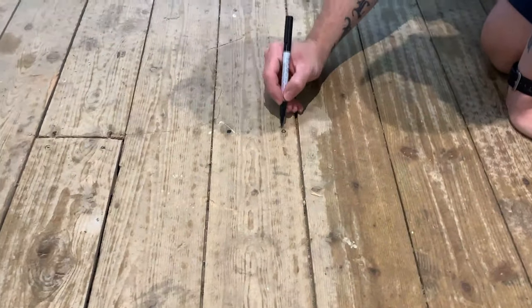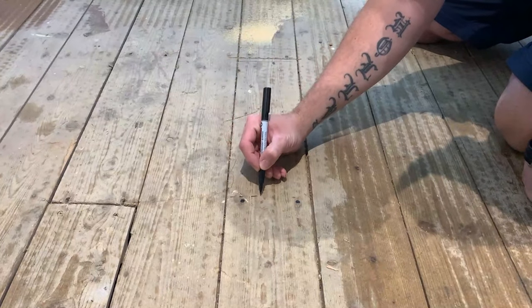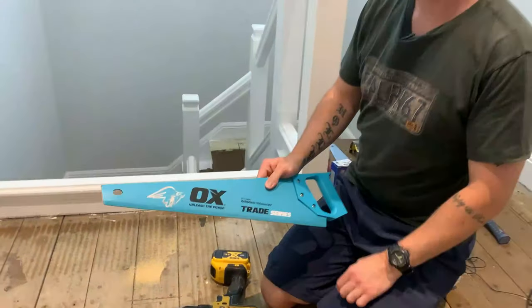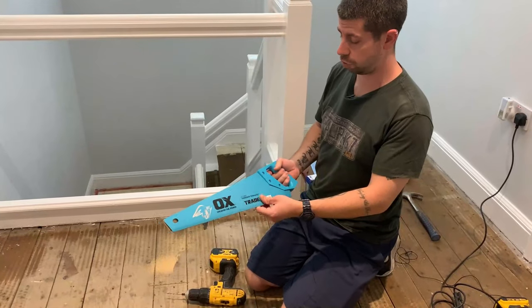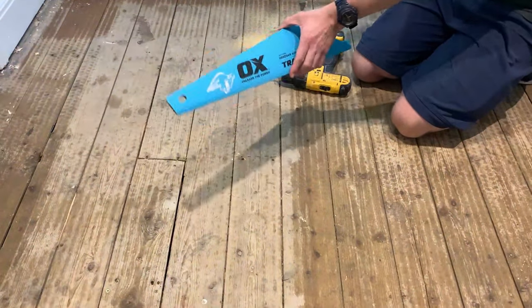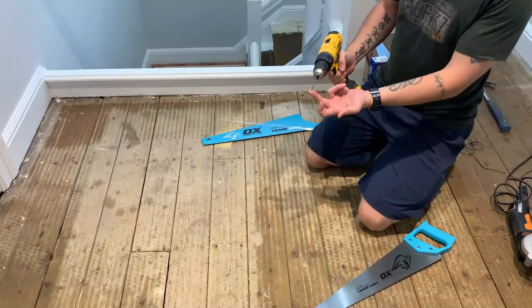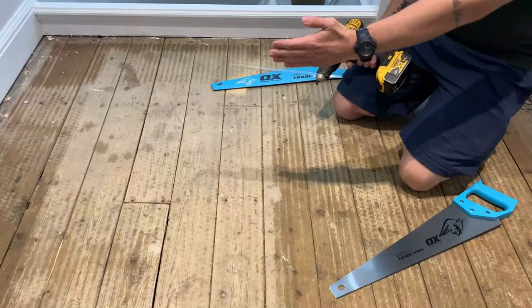That's where the nails are. I want to take this piece out so I'm going to come this side of the nails. I'm going to be using this saw for the first time — it was supplied by Ox Tools. I've heard great things about them but never actually used them; they sent me a few tools to try out. If I tried to cut through that with a panel saw it'd be quite difficult to get a start, so if you haven't got power saws and you've got a drill with a 3mm drill bit, I'm going to chain drill a series of holes which will allow me to get the saw in and then cut along the joist.